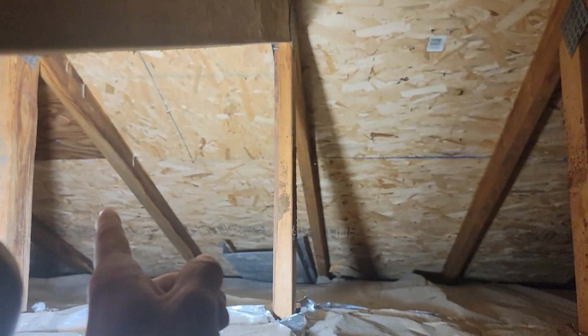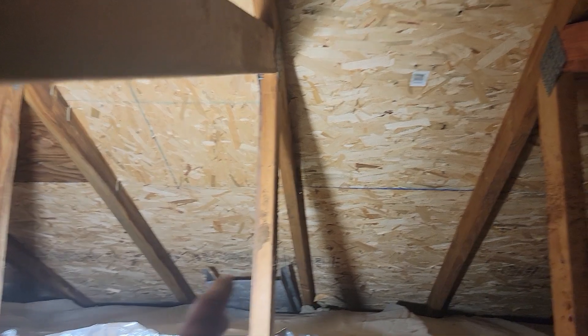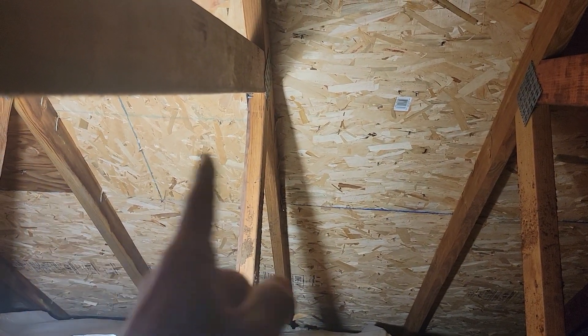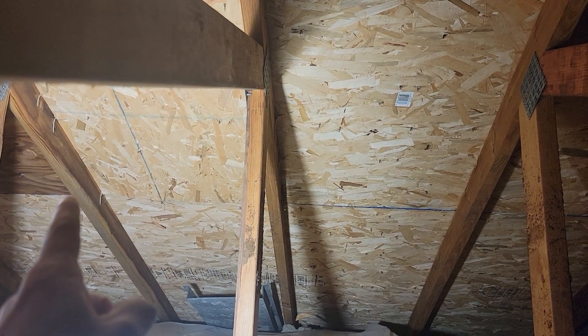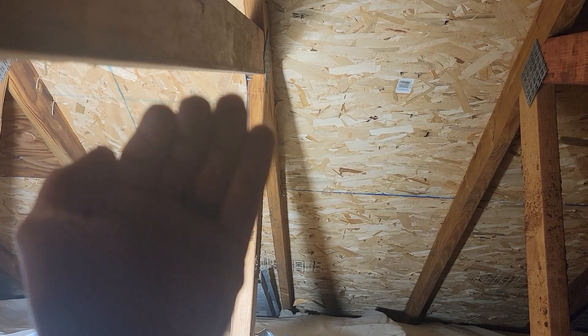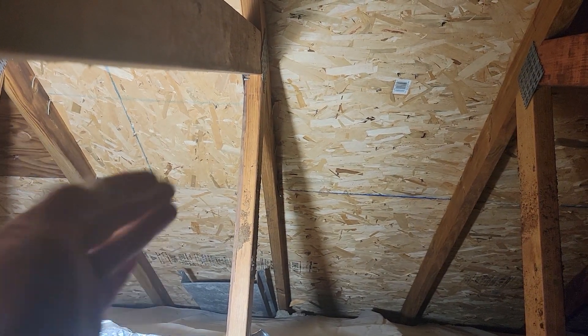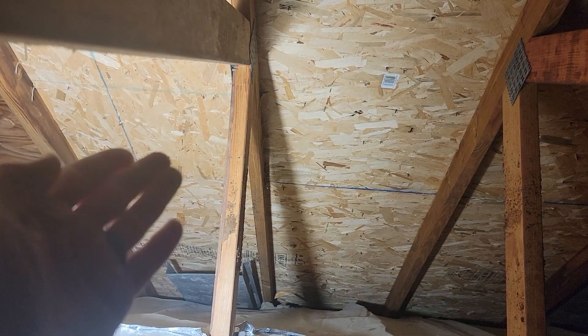This board right here is only two feet wide and goes eight feet up — it's oriented the wrong direction. Not because it's vertical, but because of its orientation relative to the supports it's resting on. If this were a barn roof with purlins or girts running that direction, you'd want your sheet vertical. But since these are rafters and trusses, you need your OSB oriented the other way.